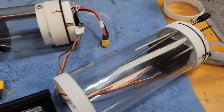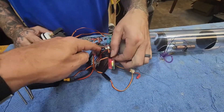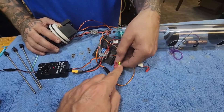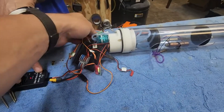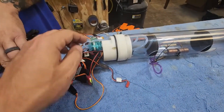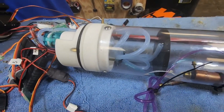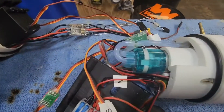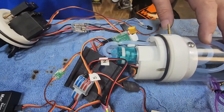We provided main power to the power distribution block. The power distribution block is firing up our BLM, which is connected to the servo tester, which is connected to the ballast servo. If we go in one direction, that vents it — so down we go — and then the other direction, our pump kicks in. Are both pumps working? Yes.